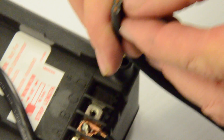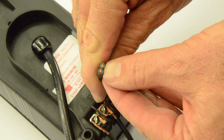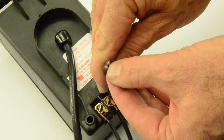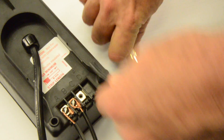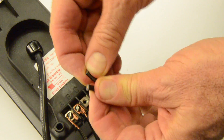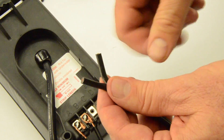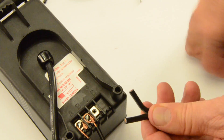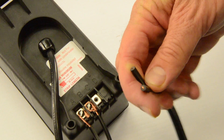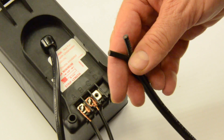The transformer is ready to turn on. I went and got the other end of the wire to make sure it's not dead-shorted — meaning the copper is not touching. I'm going to cut just a little bit here, separate the wires slightly, and put a little piece of tape on each one to keep them separate at the end of the wire so we know there's no dead short. It's a small detail but it's worth mentioning.